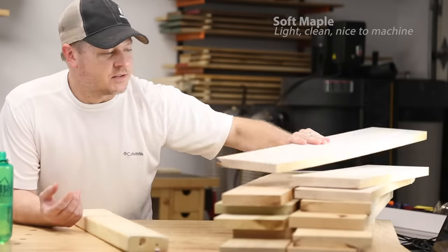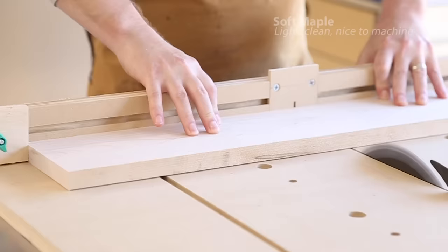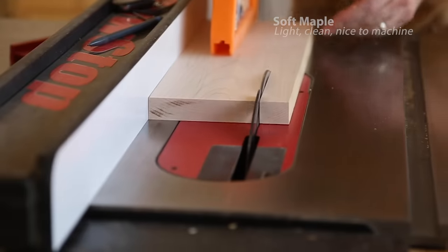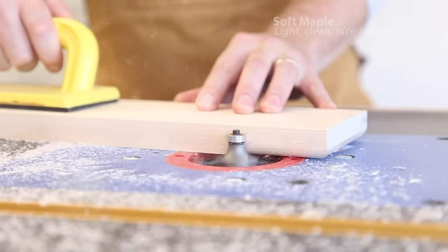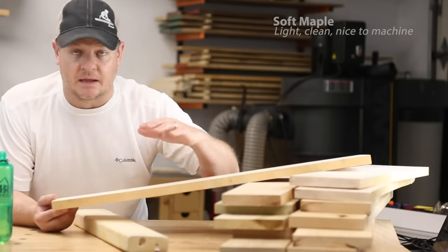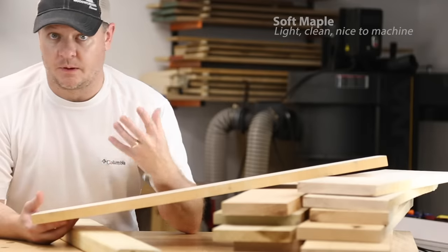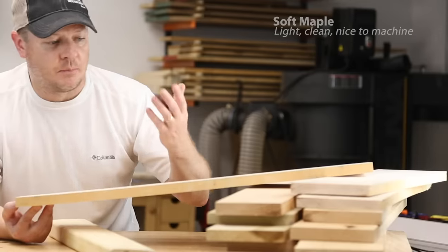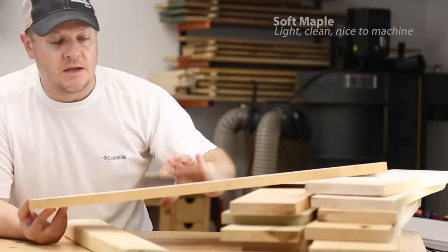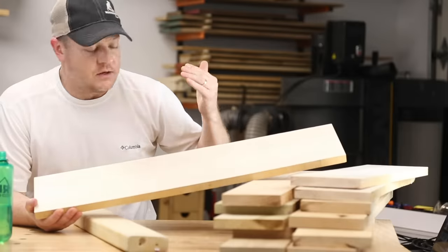This one's soft maple. It's a super clean wood, really easy to machine. Despite its name, soft maple is plenty hard enough for furniture — it's got about the hardness of walnut. It sands really quickly, and you can even carve it and shape it as much as you want. A cool aspect of this wood is that you can use various dyes to get really bold or vibrant colors, even make it black if you wanted to. The primary thing to be aware of is not to confuse it with hard maple, its more popular cousin — hard maple is a totally different species, heavier and harder. Soft maple is really inexpensive, easy to work with, and you can do a lot with it.